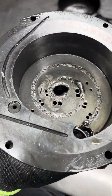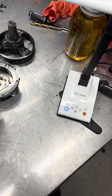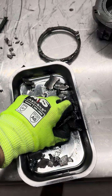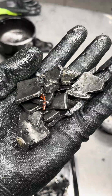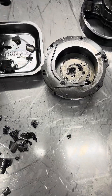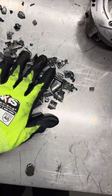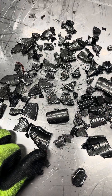No scrolls. These scrolls have been completely milled off and torn off at the base here. Just completely ripped to shreds — so much so that when we shook the compressor before we cut it open, we heard the slishing and sloshing of scroll plates. This is what scroll plates look like when they've been compressed by liquid. One thing that is incompressible — liquid. When liquid enters a compressor at a high volume and at a high rate of speed, this is what happens. You completely obliterate your scroll plate into a million tiny pieces. This is what happens when cast iron hits a liquid running at a high rate of speed — it turns into a jigsaw puzzle.